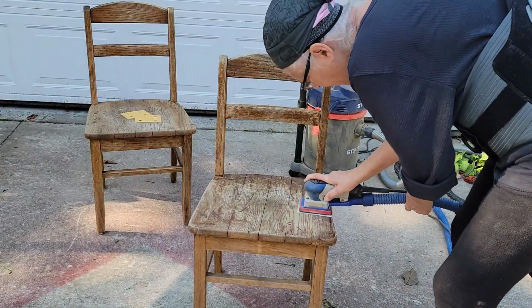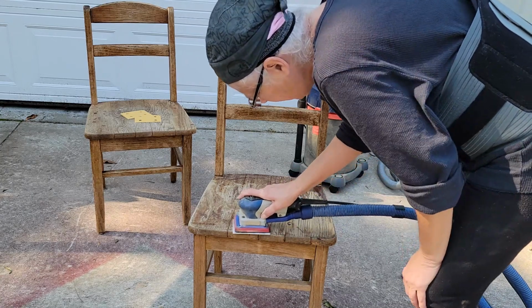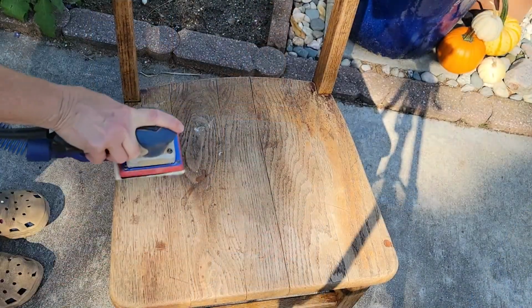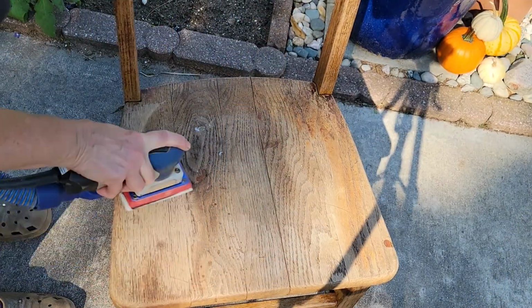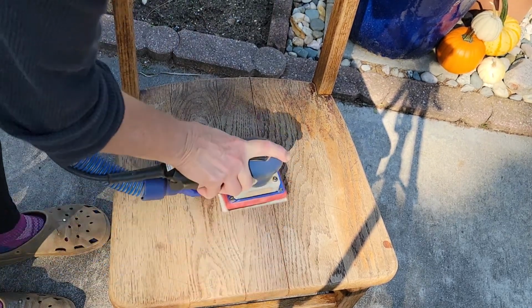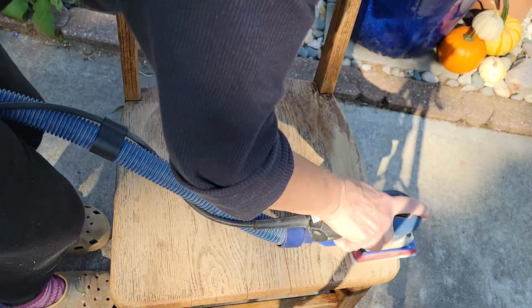I went ahead and I used my surf prep, and I just wanted to give them a good scuff sanding, if there were any loose areas that might snag or somebody might get hurt on or lifted up. All those areas needed to be smoothed down and taken away, and I did use 100 grit sandpaper.